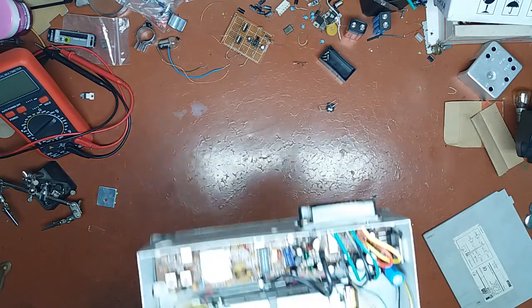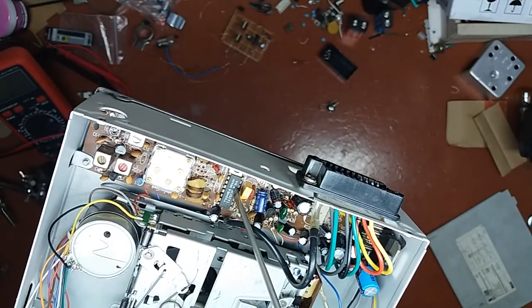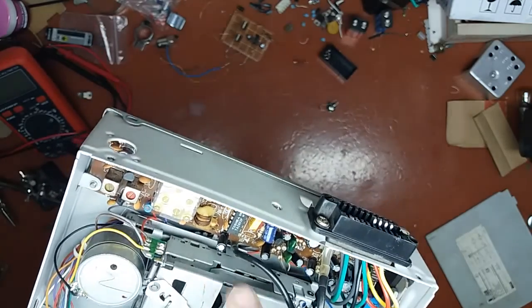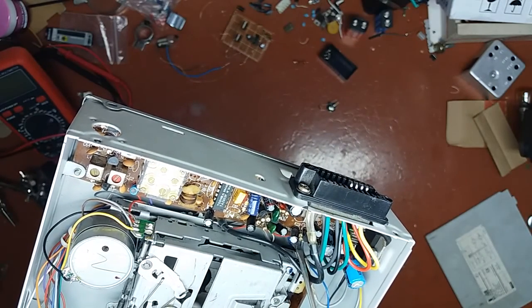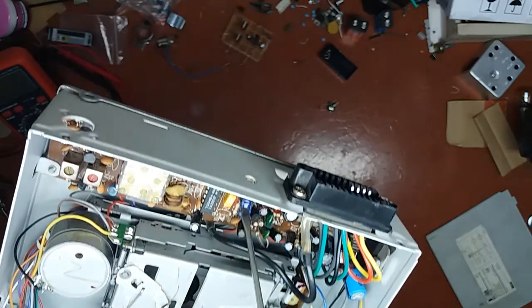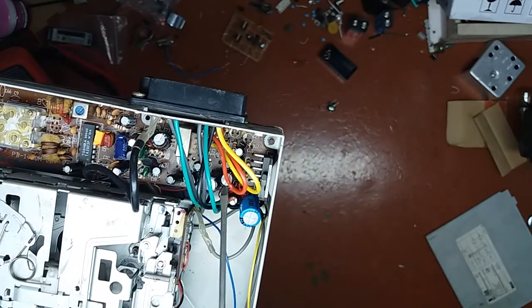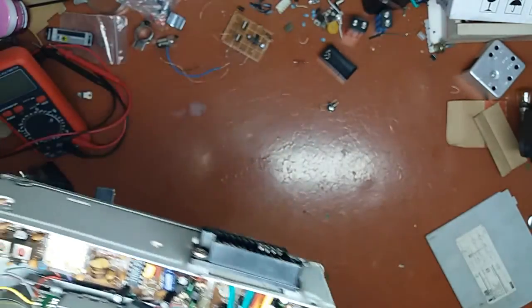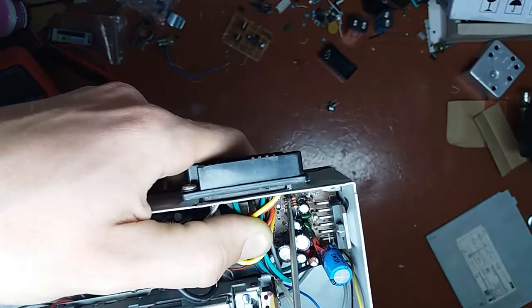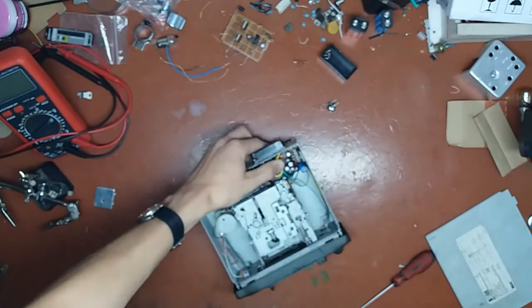So what I'm gonna do with it, I'm gonna change a few capacitors because they are bone dry. This one near the chip, this will maybe improve some tuner performance. I'm also gonna replace this one, 220 microfarad 16 volt, and I will replace these two bulged, this one and this one. Only one of them is bulged, but it's an old stereo, they're dry, and you see some empty places there and there, and that's where these two capacitors were. Let me show you what's wrong with them.